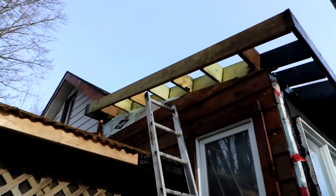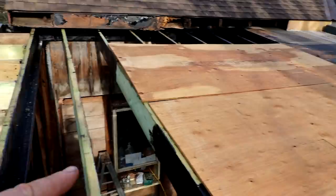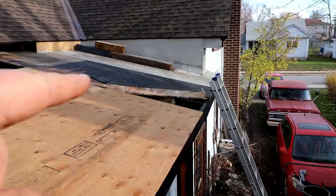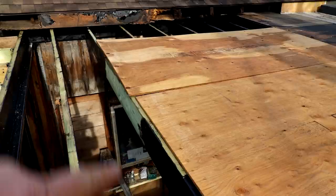Today I finished my roof overhang - you can see it up there. The next step is to get the black tar out and paint that all black up there. Here's a look from on top of the scaffolding. I've got my two sheets of plywood just sitting in place so I can work on painting the beams from above. I've got to cut the old plywood back to a beam, use part of it, and add a new section in. I need to stagger all my plywood spacing so the vertical seams don't line up - staggered like bricks.